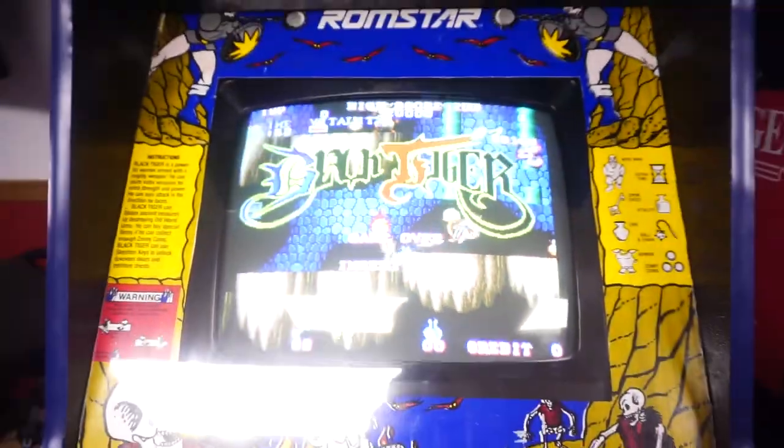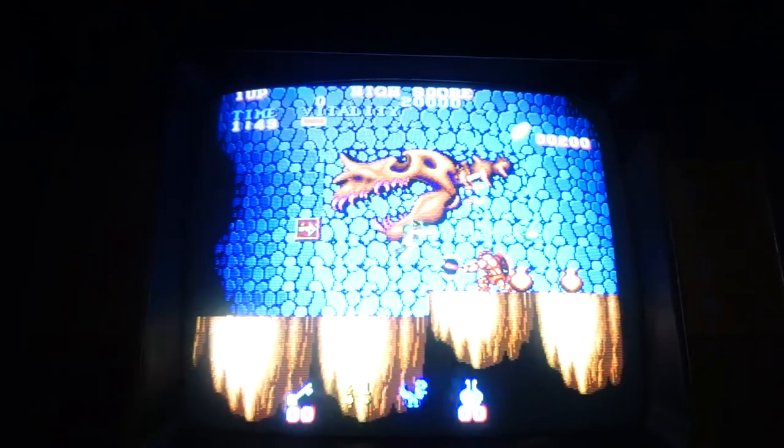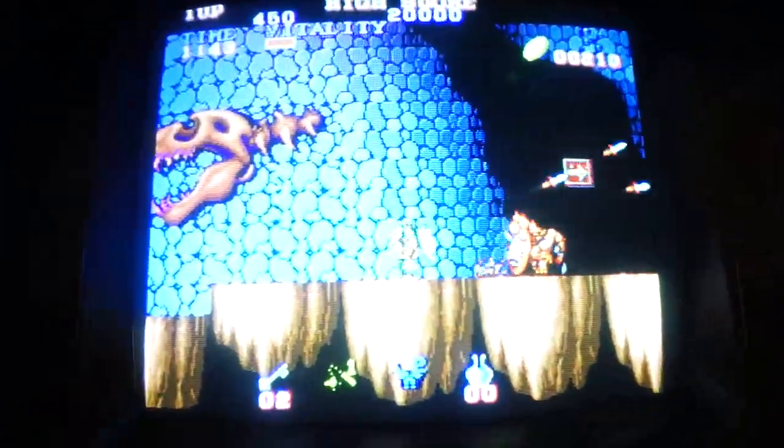Some geometry issues are present at the top. You can see a small hourglass effect in the upper 1 inch or so, and the image can't quite be widened fully with this tube. So why is this game displaying so well despite the full screen graphics? Well, my theory has shifted a bit. Now I'm wondering if a single color turned on too long causes the sag in the brightness.